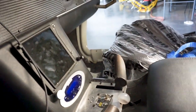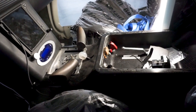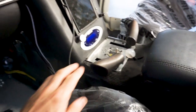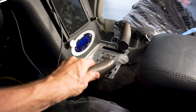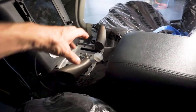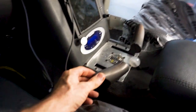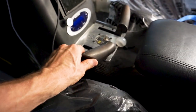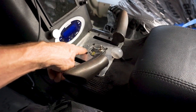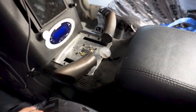The center console is fairly wide, and you can open it up — there are some switches and storage inside. There are dual throttle controls, fully connected, running to a fly-by-wire system that hooks up to the Motec ECU. I did two throttles because the cabin is so wide that a single center one would require both pilots to reach further across; this way each pilot has their own. There's a little switch on the back for the takeoff/go-around button that hooks into the avionics. In the center there are LEDs indicating gear position — locked up or locked down — and a governor controller to adjust engine RPM by adjusting prop pitch.